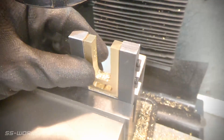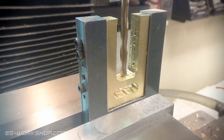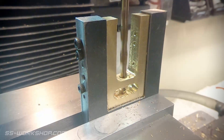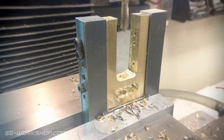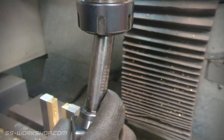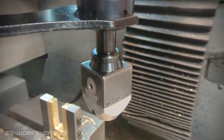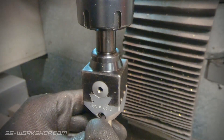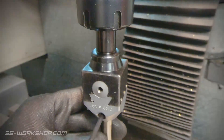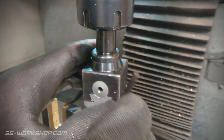Once the holes have been machined, the next thing is to turn the fixture on its end. At this point I've got a hole to drill and then I can get to boring the inside of the blocks. For boring the blocks I'm going to use this small Criterion boring head. I picked it up in an online auction a while back — it has a range of up to about 40mm. The only downside is it's in imperial, so I need to be a bit more careful making adjustments. The boring bars I'm using are carbide insert type ones.